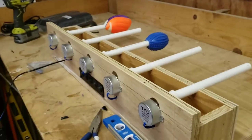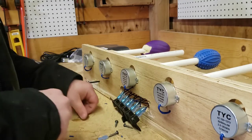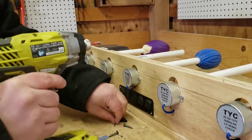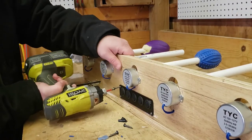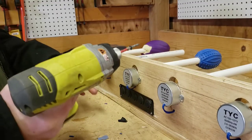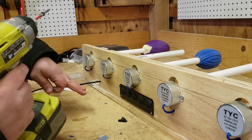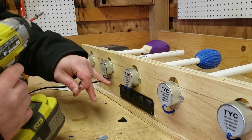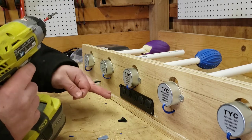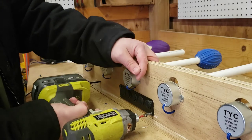So I changed the wiring on the switches, and the buttons are still working backwards. All right, well, I've tried these things every different way. Doesn't seem to make a difference. However, I did think I fried them earlier. If we go back, I'll put the clip in here. What happened was I had these on and even the blue lights came on, which hasn't really happened since. I hooked the neutral wire up to the ground pin, and it's my fault I wired it wrong, but I didn't think it worked anymore. I thought I blew the switches up, so honestly that may have done something to these, and that's why they're working backwards.